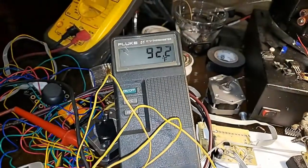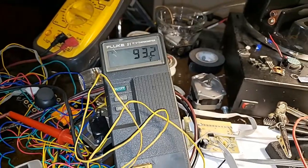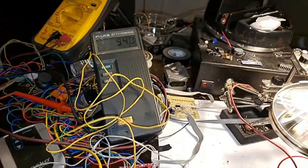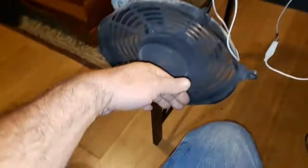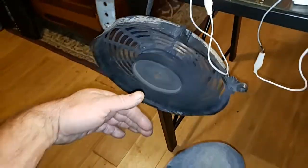Go back to a thousand, and I can increase the duty cycle — as soon as I start doing that the motor starts turning. You can already see the temperature starting to shoot up on that heat sink. I'm probably going to need a bigger MOSFET — a big one you can mount to a heat sink, a big can, or maybe just parallel a couple of them, because this is a small fan compared to the one that's on the car, although it does push some air.